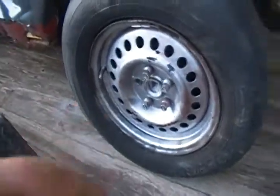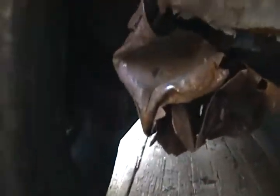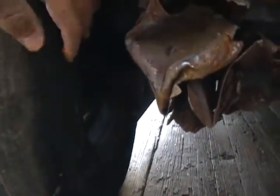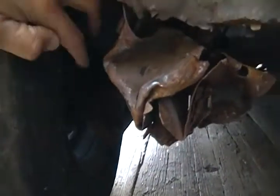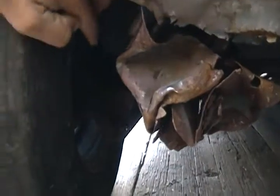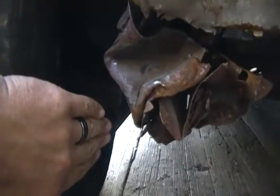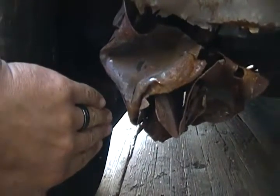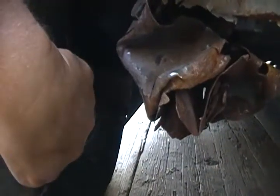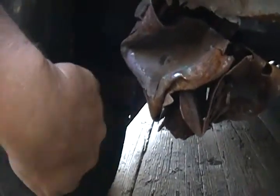One bolt here wouldn't stay in, which didn't matter — I got four of the five so I'm good. But inside here I was able to straighten out this wheel, not by straightening the frame, but there are four bolts right here — two on top, two on the bottom — that bolt this to the back of the drum. What I did is I took all four of those bolts out and put a bunch of 3/8 washers in the front because the wheel was bent. By putting those washers between the drum and the other side of where the bolt was bolting to, I was able to slide it out. I had seven washers on each of the two front bolts; the back ones I didn't do any — I just pulled it back tight, and it brought that wheel pretty much straight.